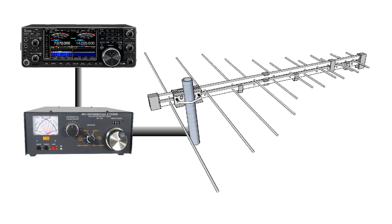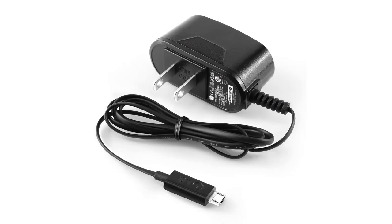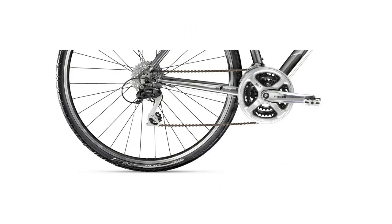In other words, the same tuner settings are able to adapt impedance in both directions. This explains why when we add a tuner to a random wire, we receive much stronger signals. Are tuners actually fooling our radios into thinking a bad antenna is a good one? This point of view has more to do with morality than technicality. Those believing the tuner is fooling their radio should also accept that a phone charger is fooling their smartphone into thinking AC mains are 5V DC, or that a bike gear is fooling their legs into thinking a slope is a flat road. In other words, a life spent being fooled by things.